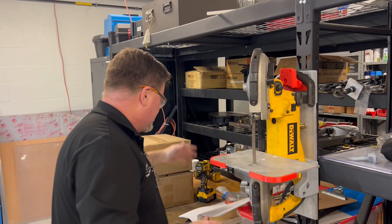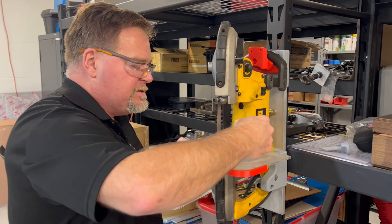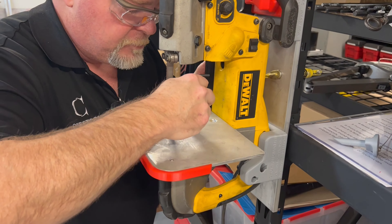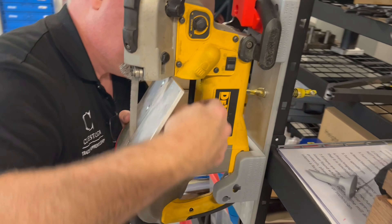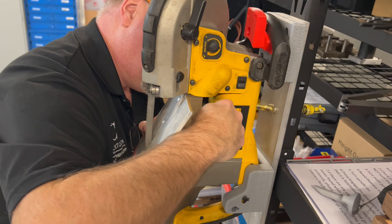Push the top blade guide in — that was almost too easy. Now I take my allen key because the spacers here are a little different. I have to look down to make sure the floating nuts are in the right spot so that when I clamp them down they bolt properly. The nuts need to line up — it's a bit tricky — but through camera magic they seem to line up magically. I put my bolt into the thread — perfect. Put the next bolt in — perfection again. Give that a tighten. I won't be taking this off ever again.